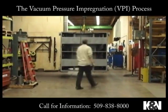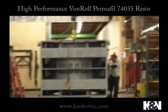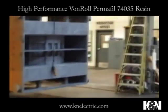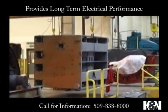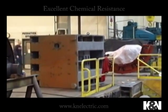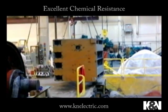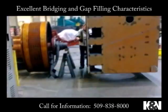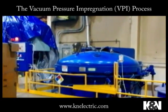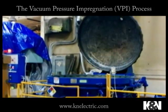This video is a brief narration of our VPI process, which stands for vacuum pressure impregnation. This is a very critical process for ensuring that the epoxy resin completely saturates the coils and the stator core, or in some cases the armature core, of a form-wound rewind. This is a process that is used by all large motor manufacturers and has been used at many repair shops for the last 15 to 20 years.